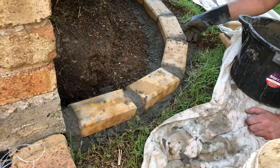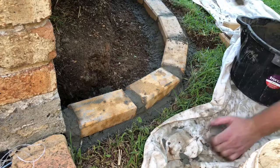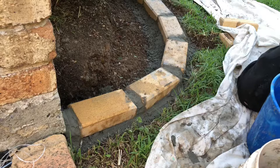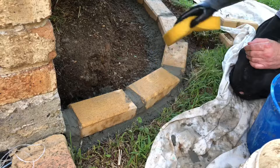You don't need to use too much mortar because you're just wasting money — just enough to pack around it and keep it neat. I'll leave like a one to two inch gap from the top of the paver on the edges so the mortar doesn't go all the way up. On the inside I'll put some decomposed granite so you can still see the paver rather than mortar. Now I'm sponging it down — it's always the most satisfying part of the process. You can only rub it once or twice because it gets dirty — just keep flipping the sponge over.